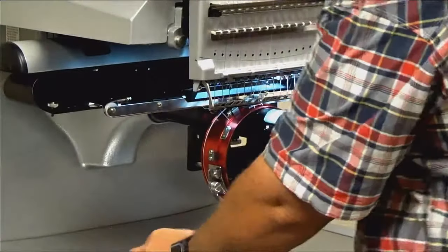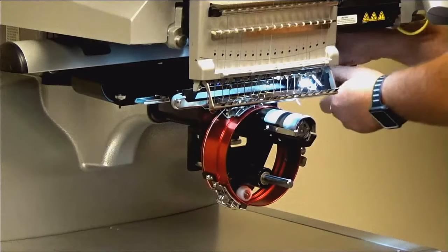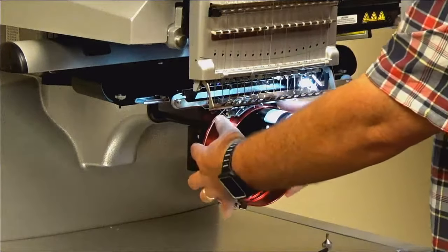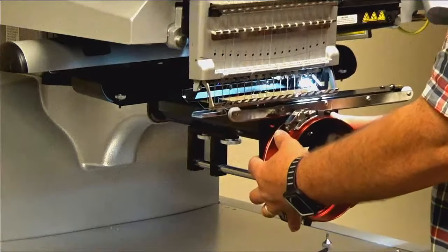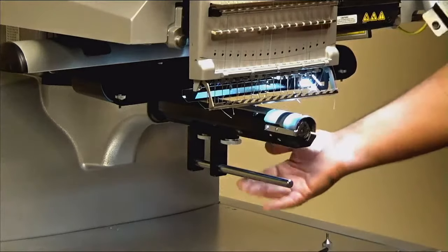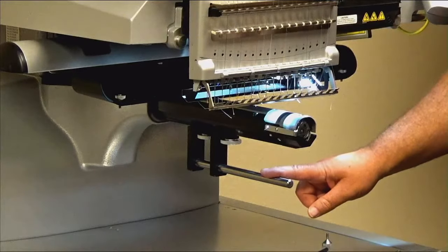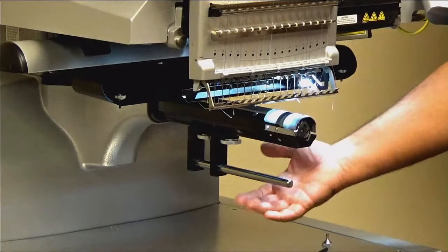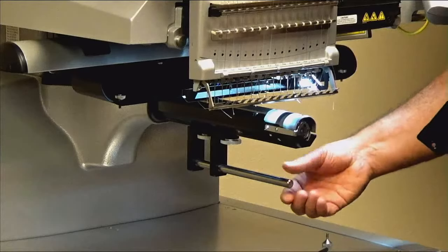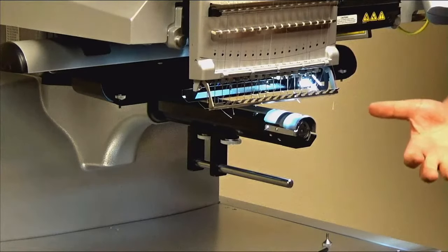To reinstall the cap driver: put the machine in E-stop, carefully slide the driver on past the grabber, angling it back slightly to clear underneath. Once on, find the inner hole on either side of the pantograph. Start one screw, then the other — don't fully tighten one before starting the other or you won't be able to get the second one in. After both are started, tighten them lightly. Wipe down the driver shaft to remove any oil residue before sewing — you don't want that oil coming off onto a garment.